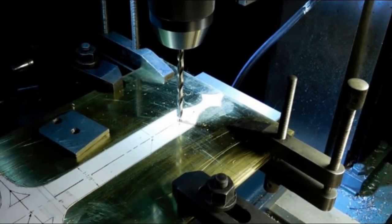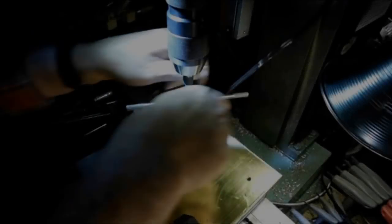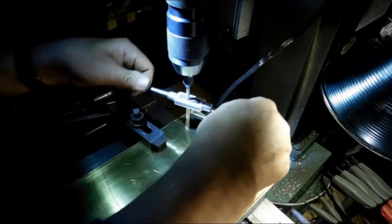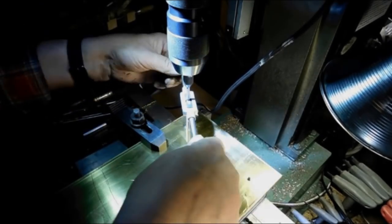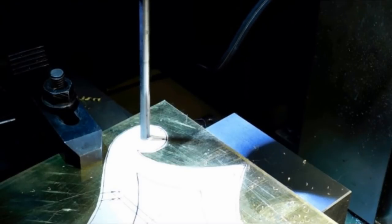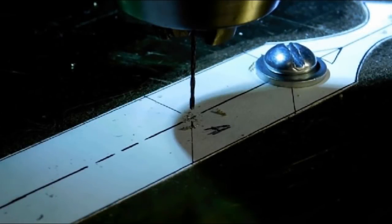And this is the drill size for the tap that we're going to be using on the back plate for the bolt. And we'll tap all four holes. We've got just the back plate down now. And we'll tap all four holes down. Front plate now, and we're just reaming a little hole in there, opening it up so that we can put that bolt in there. There you can see the bolt.